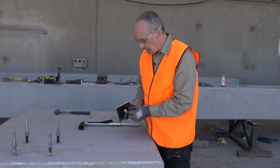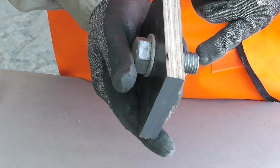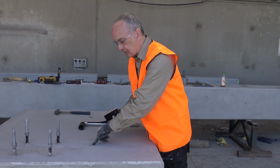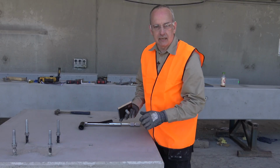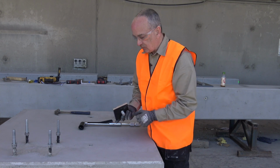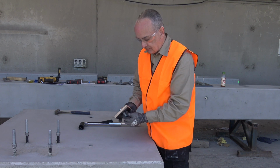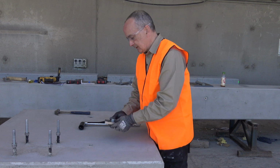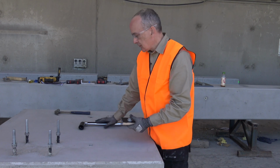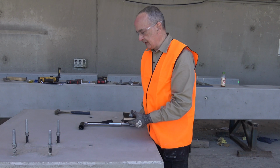Now, importantly, with the bolt length, we need to make sure that we have a bolt length that's adequate to achieve strength, which is a minimum length inside the ferrule. It's usually 1.5 times thread diameter, so in this case it would be 30 millimeters of engagement, but not so long that we bottom out in the insert and leave the fixture floating. Once we have that in place, we then apply torque correctly with the appropriate torque with a torque wrench.